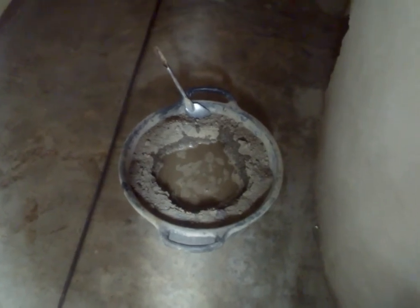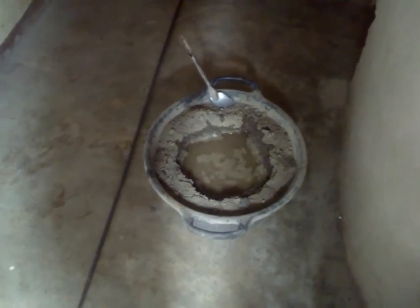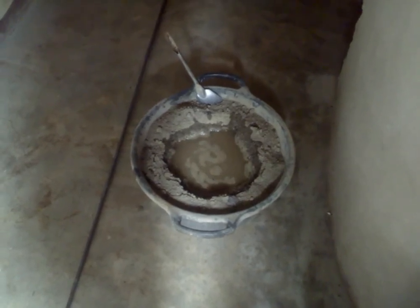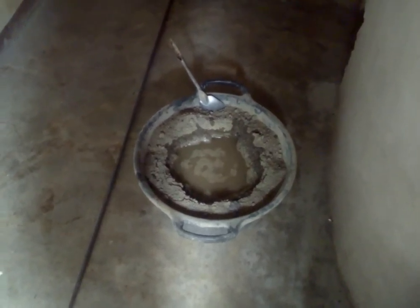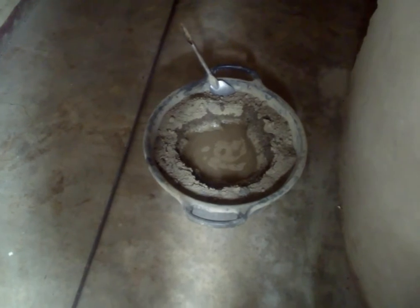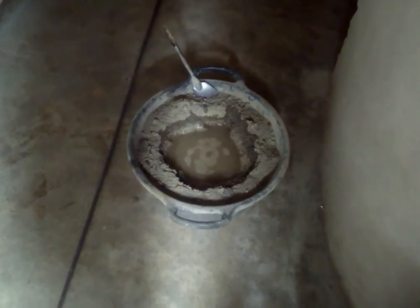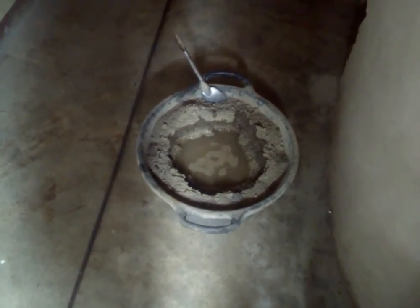This is what we're doing next. We took cement and we're mixing it up. How you mix cement to make a strong mixture is 50% cement and 50% sand, then you add water. What we're doing is letting the water soak in — it soaks up into the cement and into the sand, and then we mix it. I got a tub here to mix the cement as I put down the cement blocks.